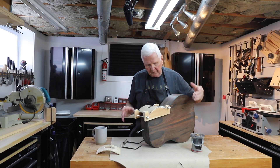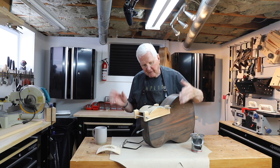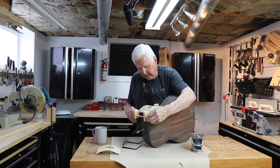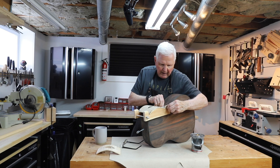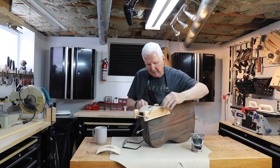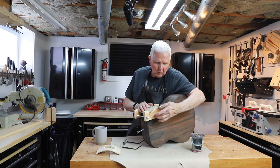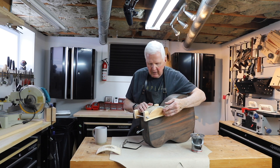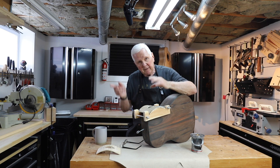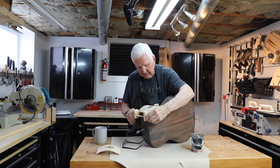Now what I also did was — I don't know why I did this but I felt compelled to make something a little more sturdy. So I've got some threaded rod here with some wing nuts on either side and these will loosen off and tilt accordingly. I then took the side and shaped this piece of wood the same as the side of the guitar. So I made both of them, taped them together, cut them on the bandsaw, ran them on the disc sander to smooth them over and they were all good.